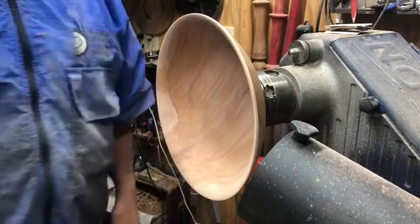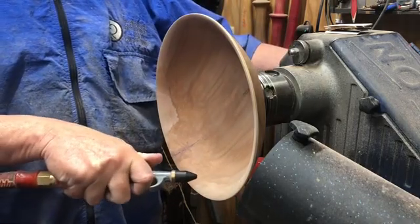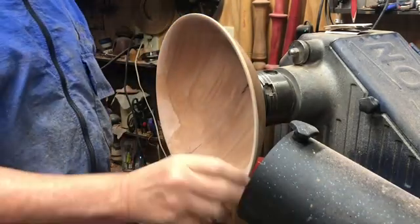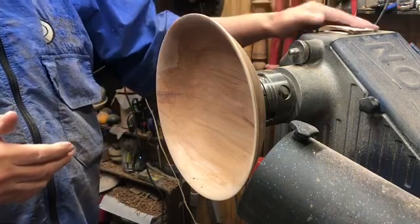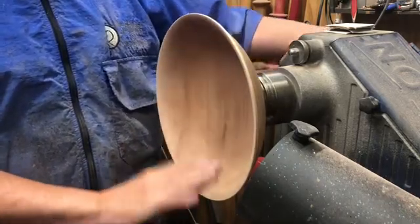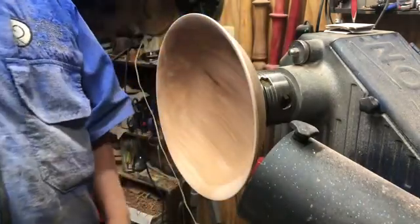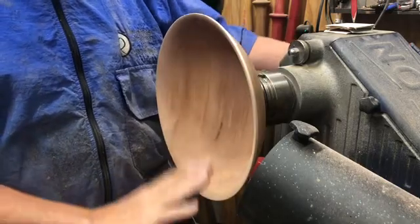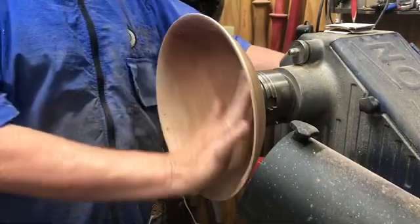Your sandpaper does get dull. Worn out 100 grit does not serve as 180 grit or 200 grit. I got brand new pieces for both using by hand and with the drill. It was all brand new before I started this video because what I had was getting dull. I had used it for a couple of projects. I'll use it 2, sometimes 3 projects. It depends on what the project is. I don't want to be wasteful, but at the same time, I'm going to use what I need to use, and I'm going to throw it away when it's done its job.